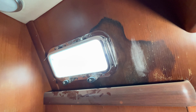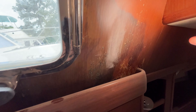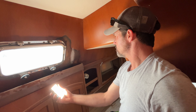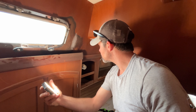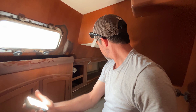Here's some of the other damage — that definitely needs work. This is damage to the actual veneer. Here's a seam of the veneer right there, so that's a potential place if we had to do a re-veneer. But the goal would be to strip the varnish off, try to repair the bubbled spots, do a quick little sand, and re-varnish. There's not much veneer to sand through. Let's go take a look on deck and see what we've got going on.